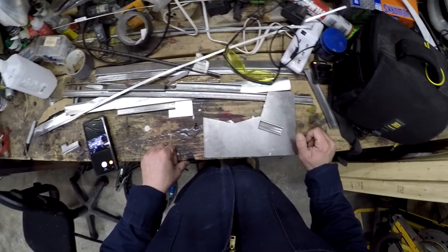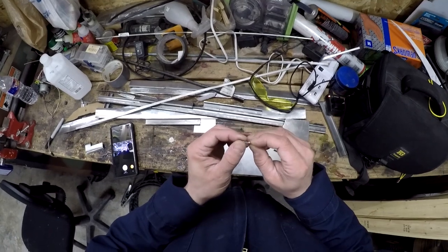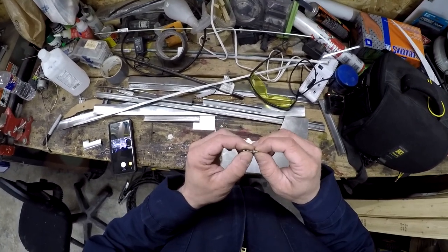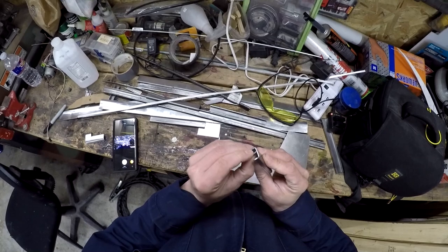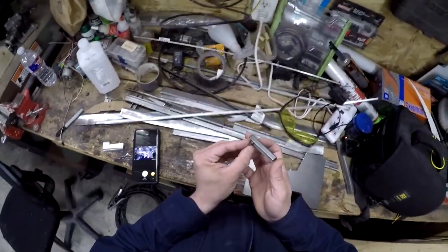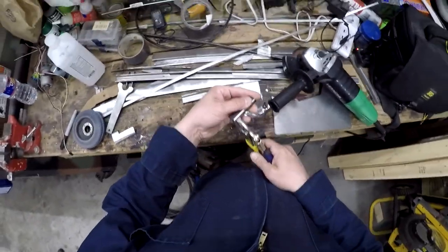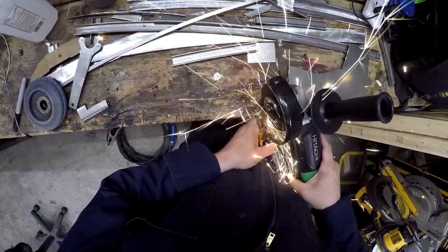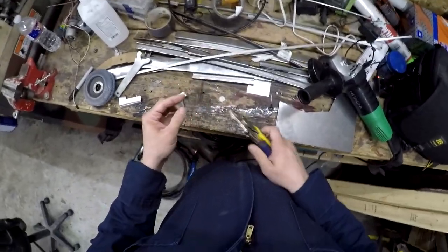I have this little spring left over from some previous RC project. The screw that fits in the head is an M3 — a short M3 screw. All I'm going to do is cut this, drill a hole so I can nut it in place, and then drill and tap the side of each part to hold it in place. I could weld it, but I want to be able to remove it for access to the mechanism. I have no preconceived dimensions for this part, so I'm going to let it do the talking.